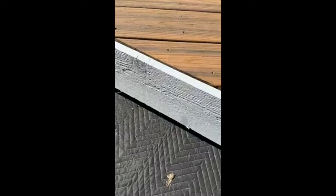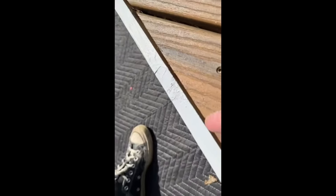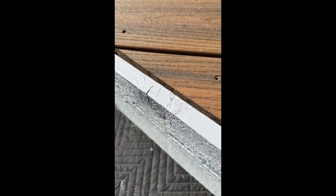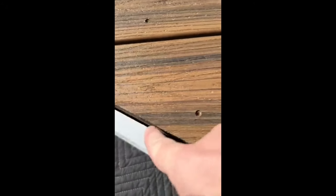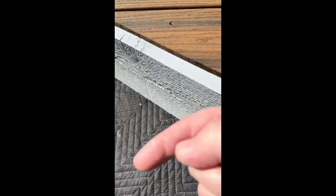Back priming means that the backside of a piece of wood, which is going to be really hard to see, is painted. Back here they didn't — they installed this as a piece of bare cedar running across here. The problem with this is that if you don't back prime the back of the wood, water can make its way through. Water will find the fastest way out of a scenario, so this deck is sitting on a lip down below, and water will collect there and may try to get out through the wood.